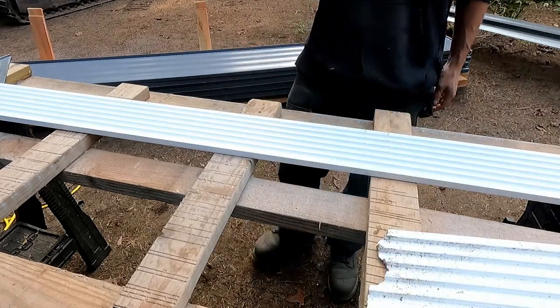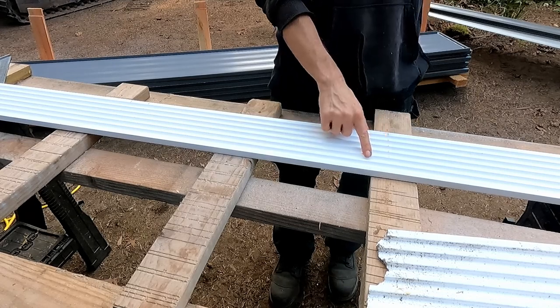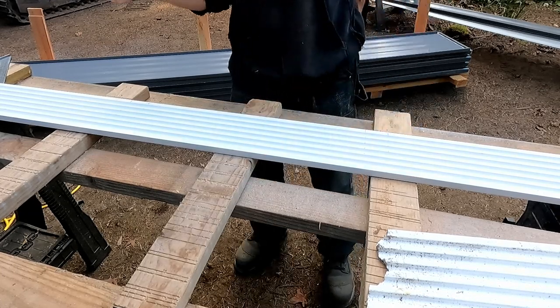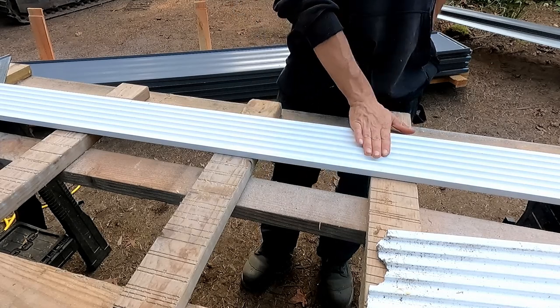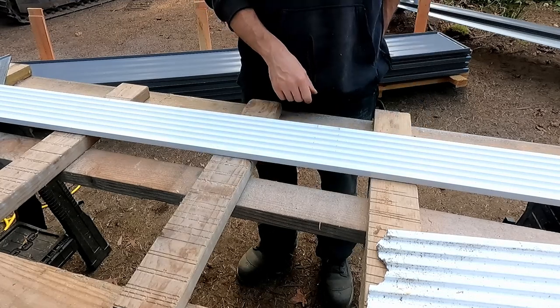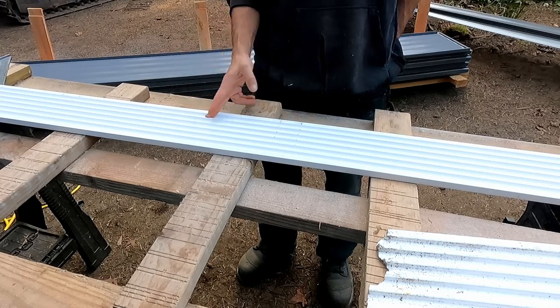To deal with that, my plan — and this might be a little daft, but I'm going to try it anyway — is inlays. I've marked out where the purlin tails are landing, and I'm going to router those out to half thickness. I'm going to take some scrap bits, router them down to half thickness, cut matching pieces, and cement those in so that in the area I need to screw into, the board is solid. It might be way too much work, but it ought to work, and I've only got one of them to do.